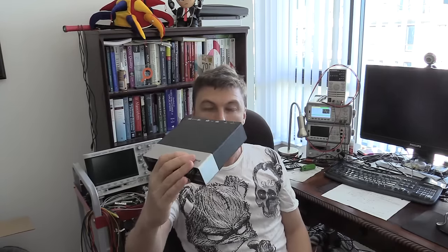What I found is that there are several solutions now available, several sound cards, I would say, that are capable of sample rates up to 192 kilohertz and with 24-bit resolution. And those ones are usually more expensive or less expensive. The sound card that came with my computer is a 16-bit sound card, and it has a 96 kilohertz sample rate.